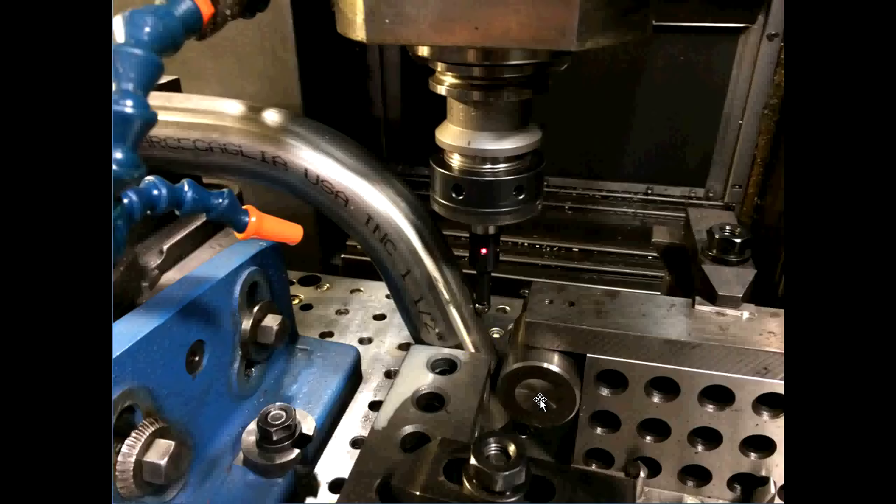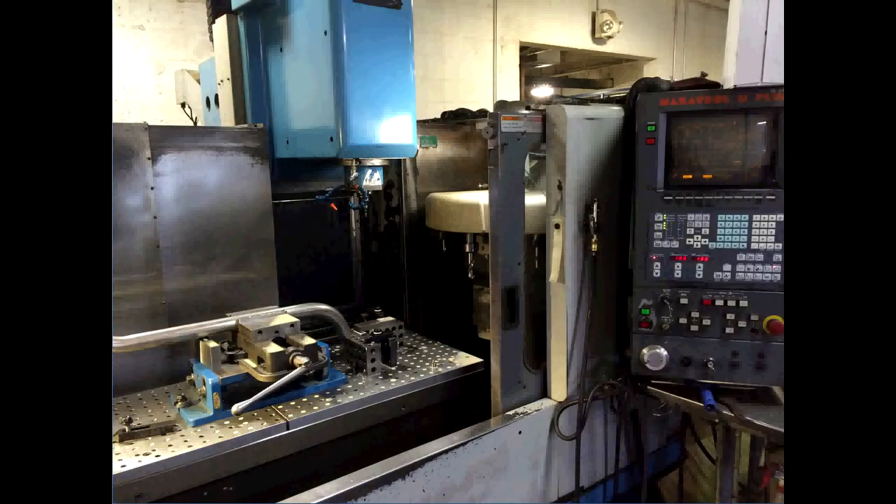I've touched the top of the tube, dropped down five inches, touched here, and now I'm all set to go. The roll ball acts as a stop every time, and the 2-4-6 block makes sure the pipe repeats correctly, perpendicular back and forth in the vise. So that's a typical oddball piece that gets passed my way — a ball stop, a perpendicularity block, and a tilt plate under the vise to clear the table.